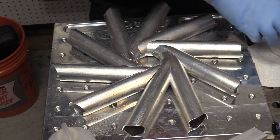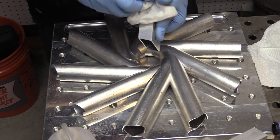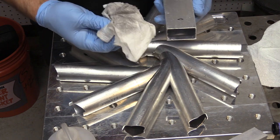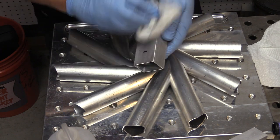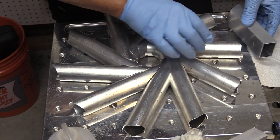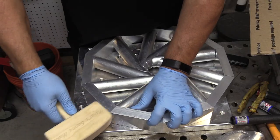We're doing a little TIG welding on aluminum today, putting together this tube hurricane part, and I'm giving it a thorough wipe down with acetone. That's all I'm going to do. I've never worked in a job shop where they would permit you to wire brush all the joints on a little assembly like this. It's brand new material — it doesn't really need any more cleaning than that.